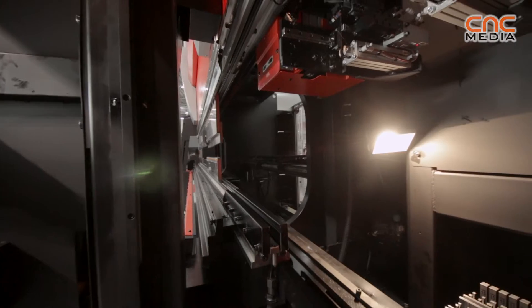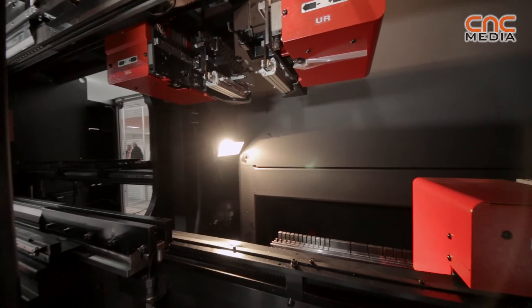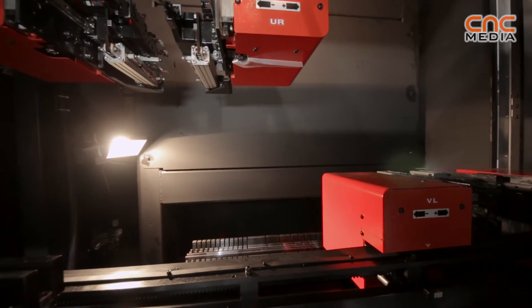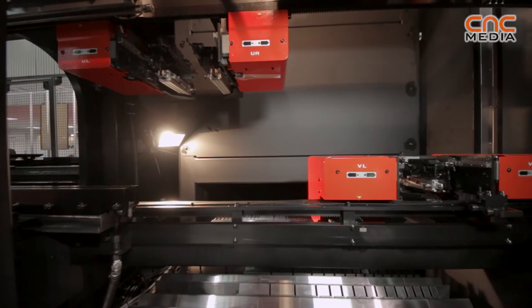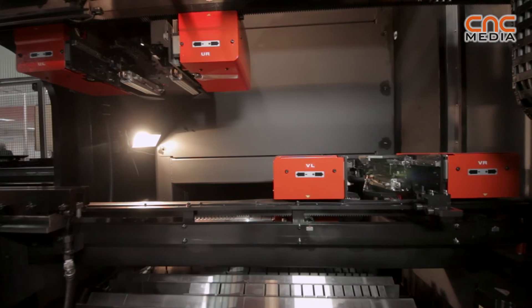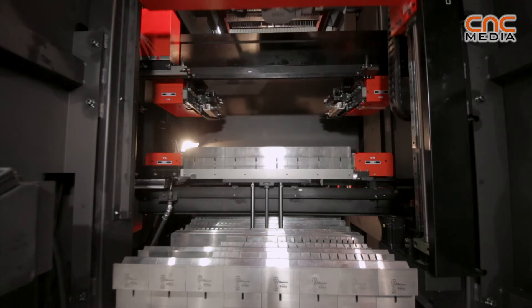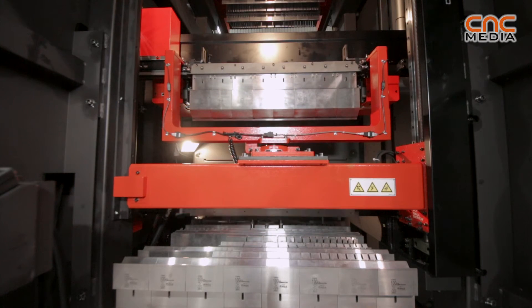So we developed the ATC machine which allows us to automatically change tools and dies. It can go from one full setup to a completely new full setup in less than two minutes, and in this time the operator can be finding the parts for the next job, loading the program in — when he comes back to the machine the new tools are ready. It's particularly useful for very complex setups or if the customer wants to run many parts with a single setup.